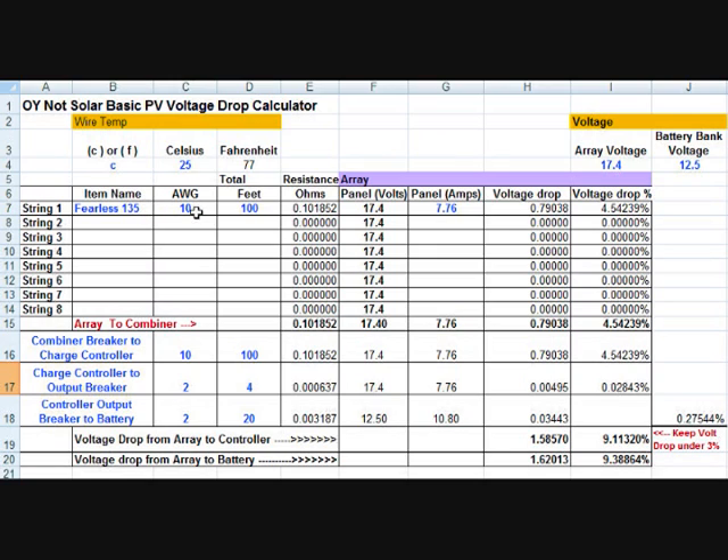All commercial solar panels come off with 10 gauge wire, and to start with I'll just assume I'm going to go 100 feet with it. Now this 100 feet is actually 100 feet of wire total — so it's 50 feet one way and 50 feet back, meaning you're really only going 50 feet away. If I assume I'm going to use 10 gauge wire from the panel to my grid tie inverter 50 feet away, this is telling me I'm going to lose 4.54% — my voltage is going to drop over that distance, meaning there will be losses in the wiring itself.